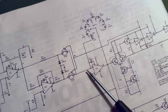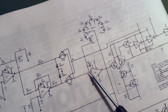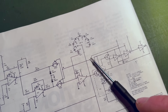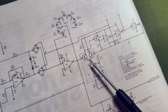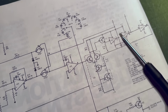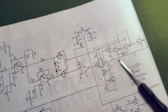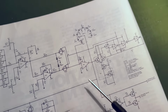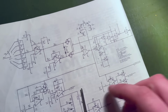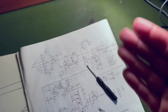Okay, so we're going to get the changing state of voltage from positive to negative or negative to positive on the input of this integrator, which is going to change the direction of either the rise or the fall on the output, until it meets the higher or lower threshold of the comparator again, which again changes these switches around to on or off, which is going to repeat the whole process. And so you're getting this feedback loop, which is creating the constant oscillation. It's unstable. This circuit is unstable. It's going to constantly change between one state or the other, and that's how you create the oscillation.